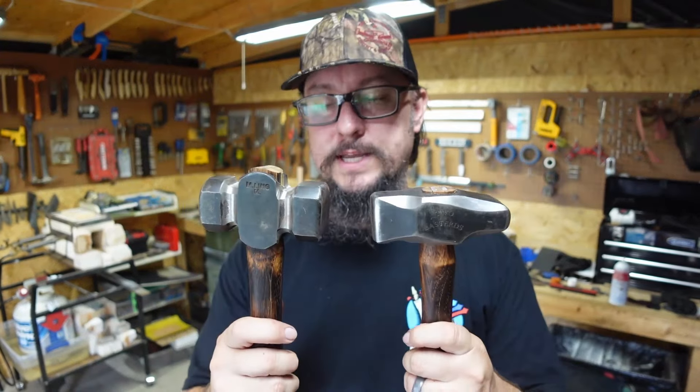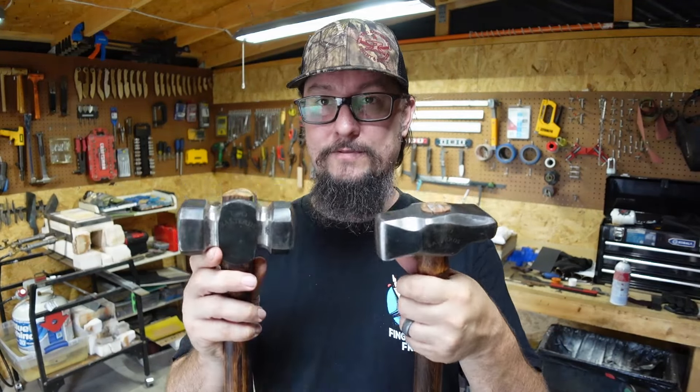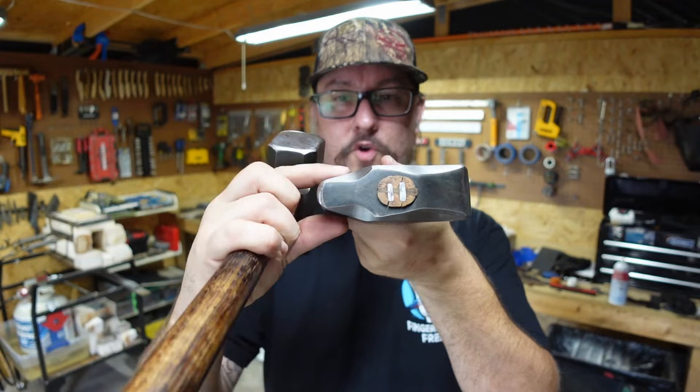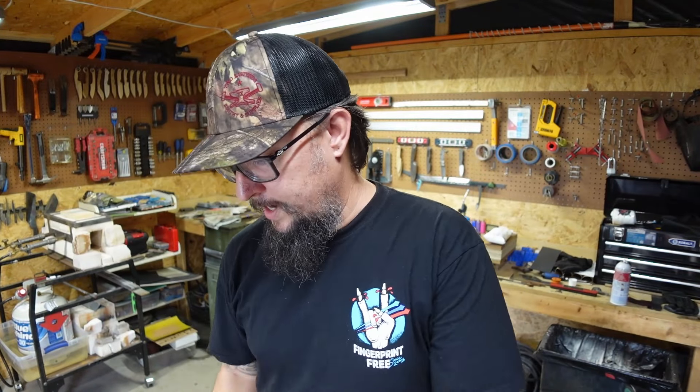It's not just for that — this side lets you forge in here, and the other side lets you get into those areas, forging finger choils, profiling things like that. This hammer is a very useful, versatile tool. Now, if these hammers aren't in your budget, Frank and Nita from Two Basterds would tell you to go to Harbor Freight, grind those little sledgehammers into these profiles — round one side, knock corners off the other, then create a straight peen and cross peen by grinding.